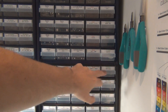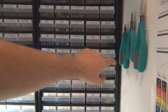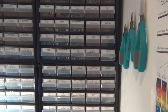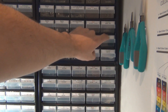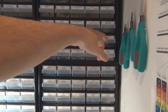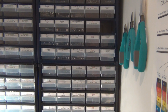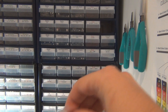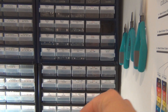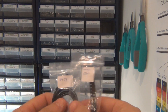The BS107 you use sometimes - you'd probably want to get a few of those. The 78L05 is a 5-volt regulator often used in conjunction with the PT2399, so if you're going to get those delay chips you might want to get a couple of these as well - it regulates the 5 volts into the chip. And then there are the JFETs. I don't use through-hole JFETs anymore - I don't know if anyone does. Unless you've stocked up on them you're not going to be able to get any. Here's what I've got in the way of what I sell.